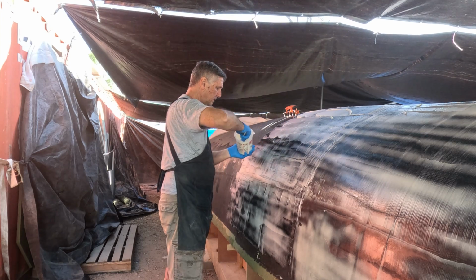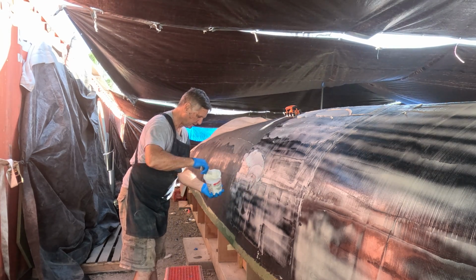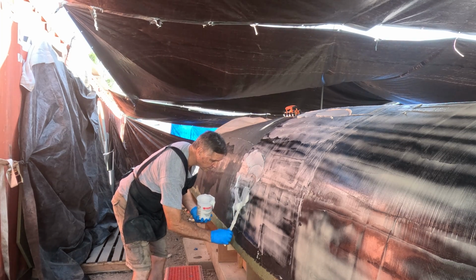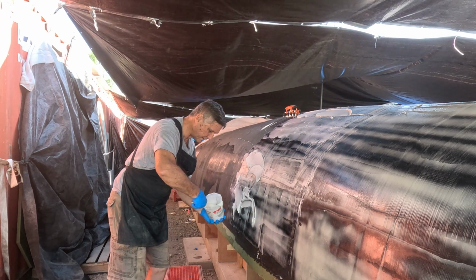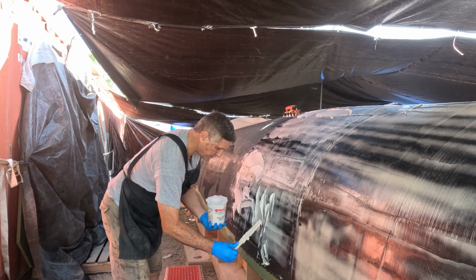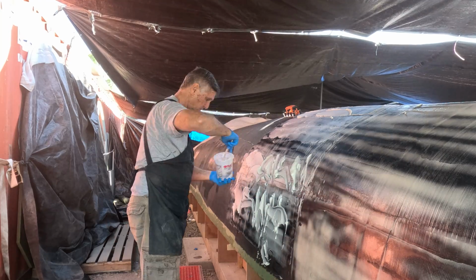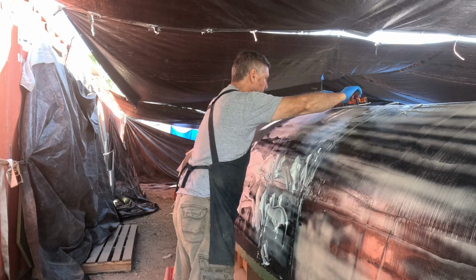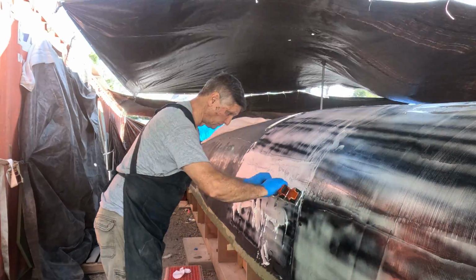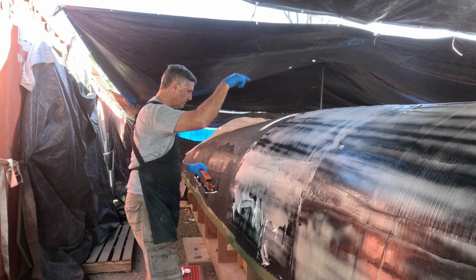The other thing we want to do is, when I do receive one of these, get it out of this container onto the side of the canoe here, because it lasts much longer spread out than it does concentrated in here. So even though I'm not going to trowel this part for a moment, it's better to have this stuff on the hull. And it doesn't matter if I put too much over here. It'll just trowel off and we'll move it over to a different part of the hull at that point. So out of the bucket. I'll put this back in the bucket temporarily because I'm going to be doing the other side of this in a moment. We'll move it over there.